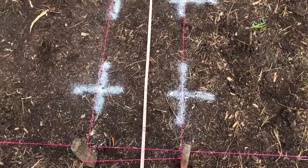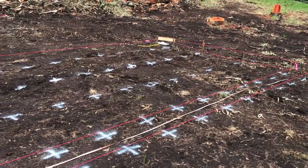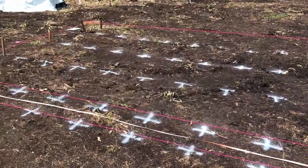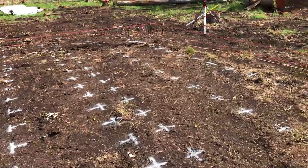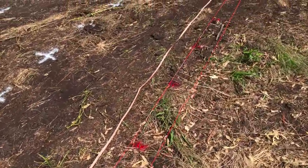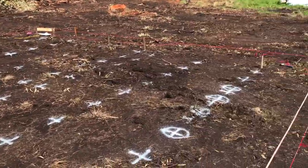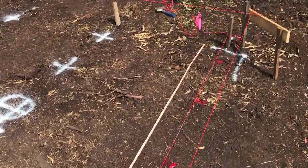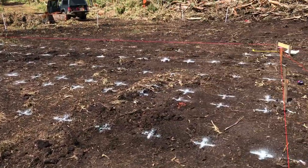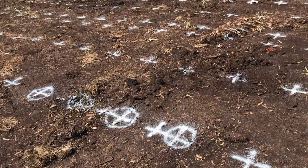Just three more rows to do and I'm done, then I start doing levels. It's all done — I ran out of chalk so I had to use some enamel paint I had in the car. All the footings are marked. I just need to get an idea of the fall so I can work out exactly how long these pieces of steel need to be, since many of them go down to the concrete. Better get cracking.